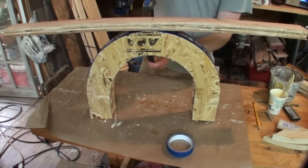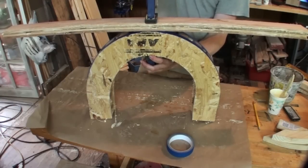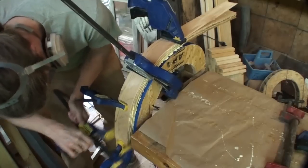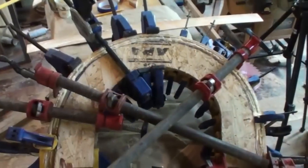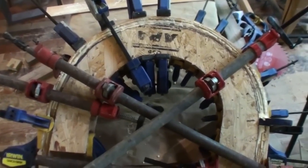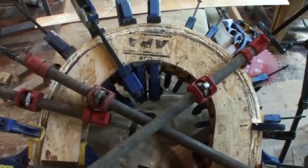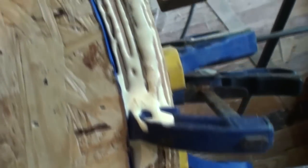When it comes to clamping, you want to make sure you're getting as many clamps on there as possible and getting even pressure. You want to start from the middle and kind of work your way out to the outside — that will make sure you don't end up with any bound-up areas. Here's the upper part of the trim all clamped together, and you can see it's quite a bit of clamps and it could still afford to have more. If you're doing a piece of furniture, you're going to want to make sure that you have this really clamped down to avoid any gaps in the glue seam.